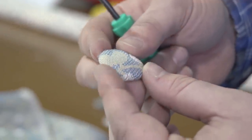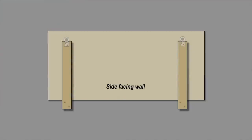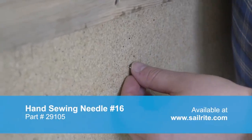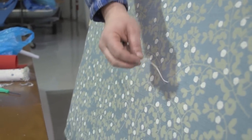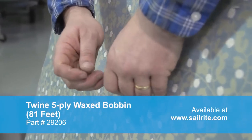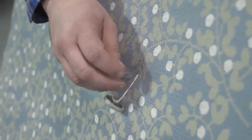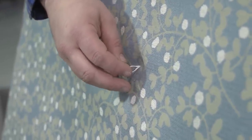Three holes have already been drilled into the headboard where we want each one of these button forms to be installed, using an eighth inch drill bit. If you have not done that and already have installed the fabric, be careful to drill through the board only from the back side. Do not drill through the batting or through the fabric. Using a number 16 hand needle and some twine we're going to thread the needle. This is a pre-waxed twine, though a heavy duty twine will work just as well. Insert the needle through the hole on the back side of the board and push it through the fabric on the front side, then run the twine through the loop on the back side of the button form. Then poke the needle through the fabric yet again through that hole back to the back side.